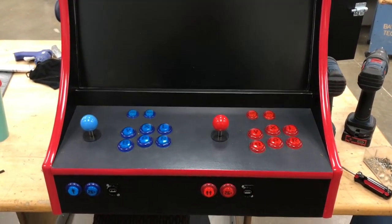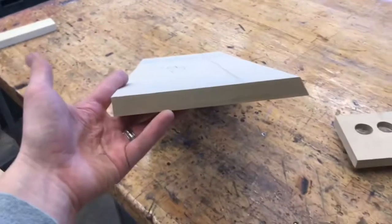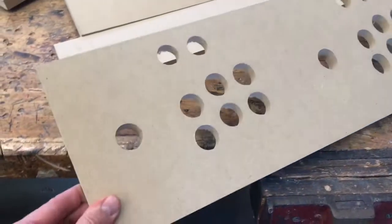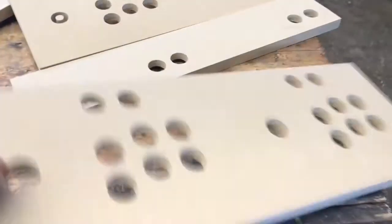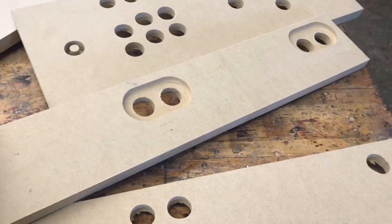I did make a couple of variations, and that's what I wanted to highlight in this video. I built it a little bit differently. I had some butt joints that they didn't have. When I made the buttons I did recesses on the back side using a CNC router — which you could do with a regular router and a spade bit — so that the buttons sit a little bit higher up inside there.